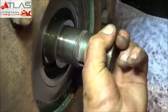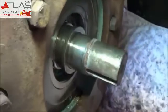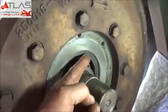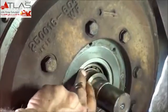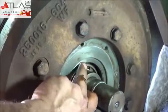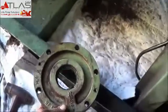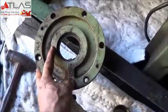As you notice, this is a dummy shaft — it's not part of the actual rotor itself. One other thing: you've got to be really careful that you don't disrupt your shims over here. These are shims right here and they kind of move around. They're kind of stuck in place, but you want to be careful that you don't lose these or misplace one. I just need to find a socket that I can fit the inside diameter of this, and I'll drive this seal out and put a new one in.